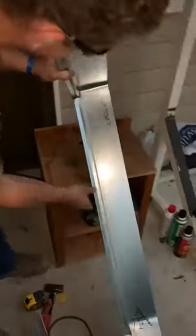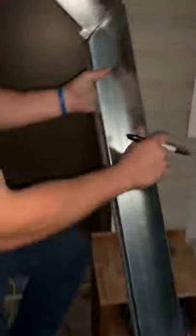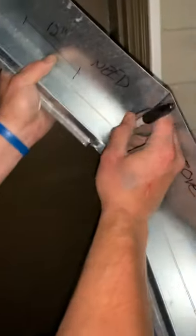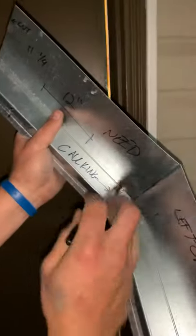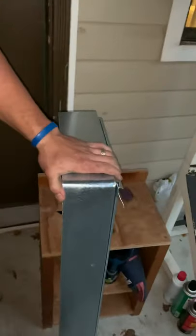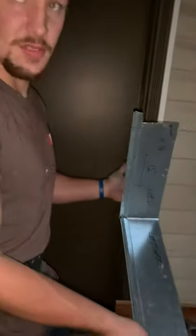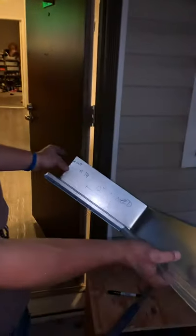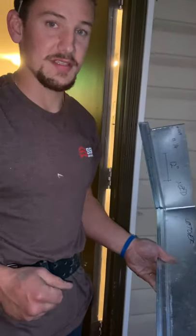Same thing once you're done with this whole area right here, you're gonna want to add caulking right there and fold it over. I like to bend it first and do a dry run, and then add the caulking, because there's no reason to add caulking if you messed up your cut. So this is a perfectly 12-inch inside corner - it'll go right here and be able to wrap that edge. That's it guys, let me know if you have any questions, leave them in the comments below.